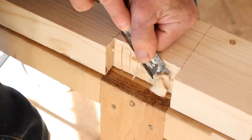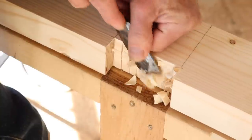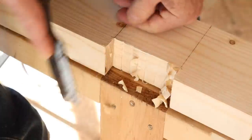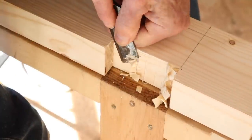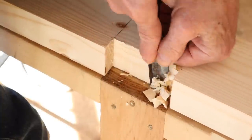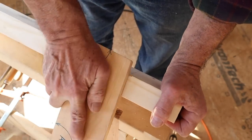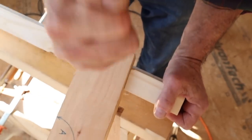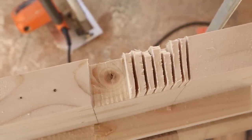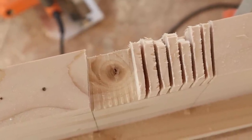A sharp blade is a real joy to use. If you've not yet seen my YouTube video showing how I easily and quickly sharpen chisels, you need to check it out — I'll put a link in the description below. I use the helper block to make sure the notch is just right. You want the leg to fit snug but not too snug. If there's a knot in the wood where your notch is, forget the chisel — use your saw to make more cuts and clear away the knot.